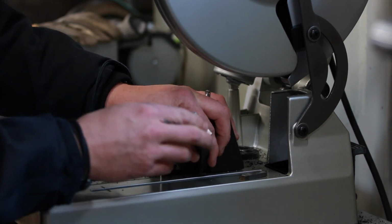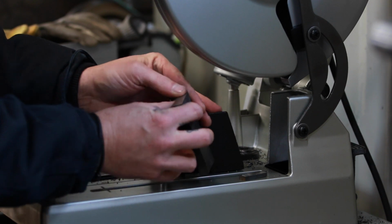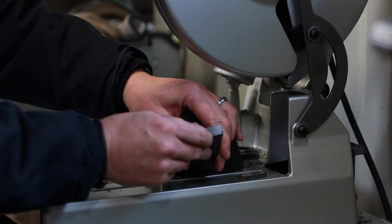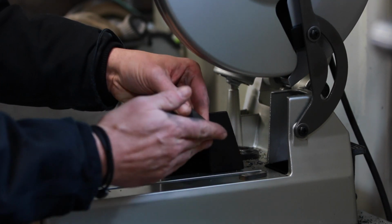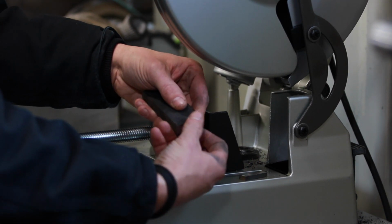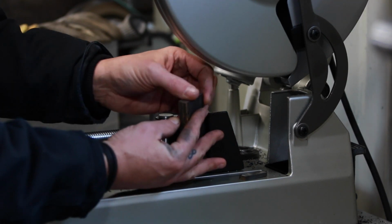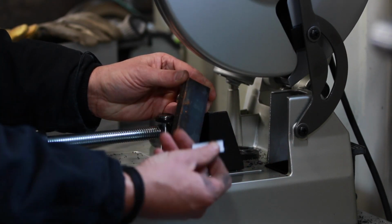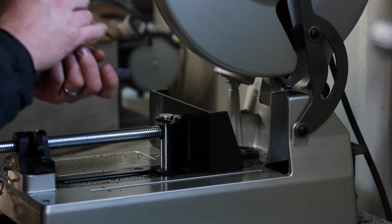Whatsoever. When they say this is a cold cutting saw, it's actually not even warm. And look at the finish on there. That's a pretty impressive finish, but I can't believe it. Slightest little bit of a burr. You know, if I was just welding this piece, I don't even think that would affect my weld at all. I'd probably still hit it, but certainly not even enough to cut myself on. You can just feel it there. One pass with a file and that thing's gonna be cleaned up. I know they called these cold cut saws, but I didn't think it was that cold. That's impressive. Let's try a piece of angle iron now.